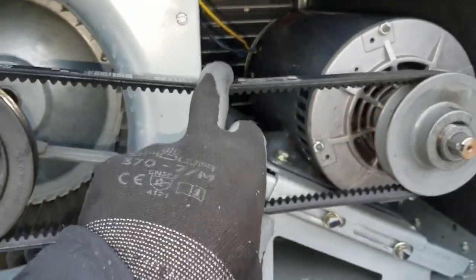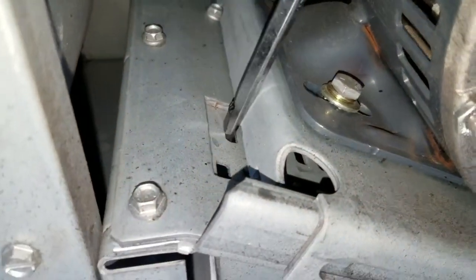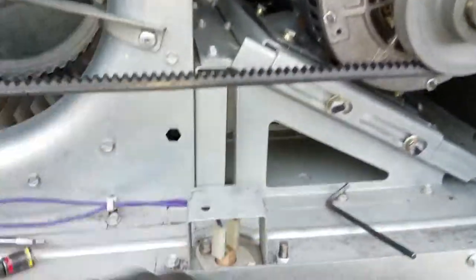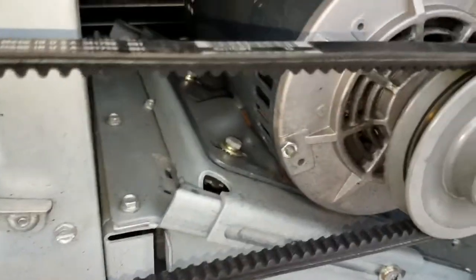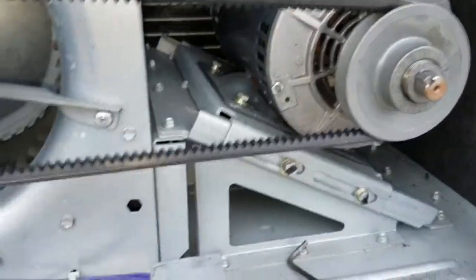I slide it up just by grabbing back there and lifting the whole thing, kind of shaking it. Look at that — the tension is almost just perfect. If I needed it tighter, you have these little slots right here — stick your screwdriver in there and wedge it that direction. There's another slot here too. I don't need to adjust it though because the tension looks good. Use a crescent wrench to tighten — you always want to be careful not to over-tighten it. There's another bolt in the back that I need to use by feel, which means both hands. That's it — good luck.